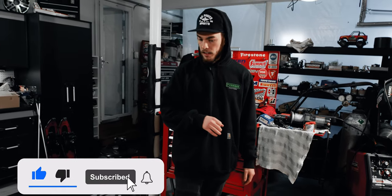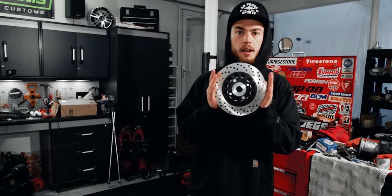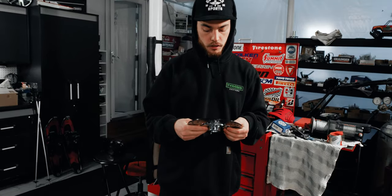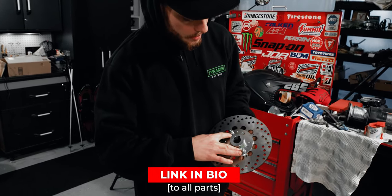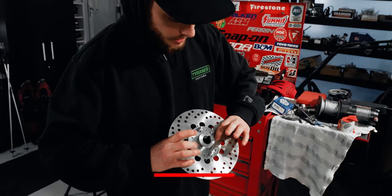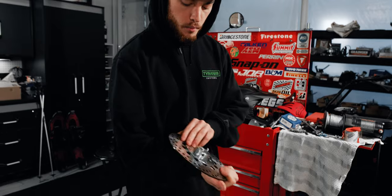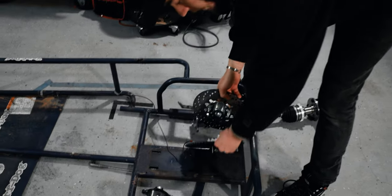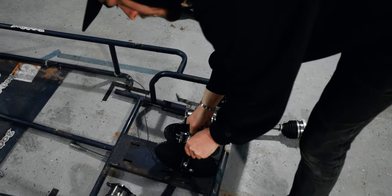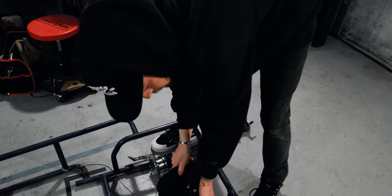So for today, first thing I wanna do is our rear brake disc. I bought a universal hub for it off of Go Power Sports. On here, it's got two holes that line up. And here and here, we're gonna need to put two more holes. Drill through here, put a couple more pieces of hardware in it. Then this is gonna get mounted somewhere right in here. And then those hubs will go on either side through the pillow blocks that we have.